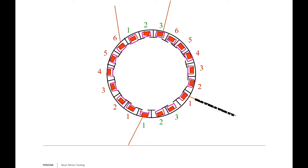Most motor windings—especially submersibles—will have three wires: black, which is part of your main winding; red, which is part of your start winding; and yellow, which is the interplay between the start and the main—it's the bridge.